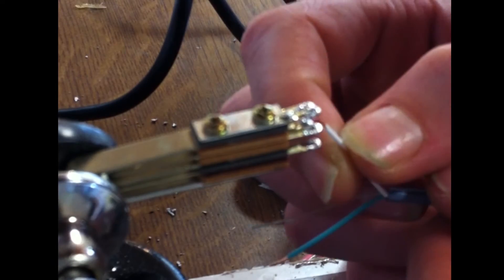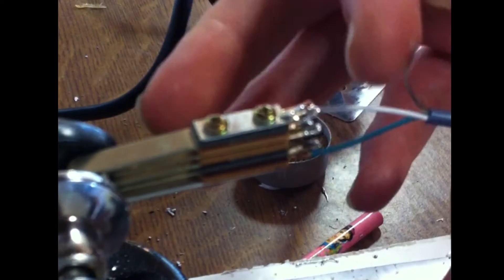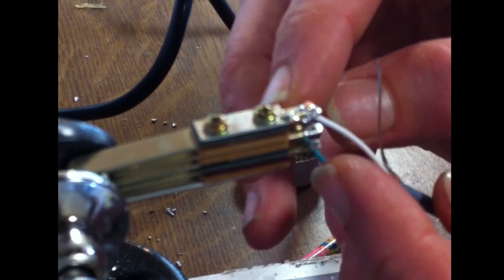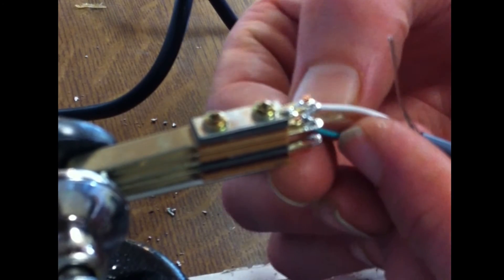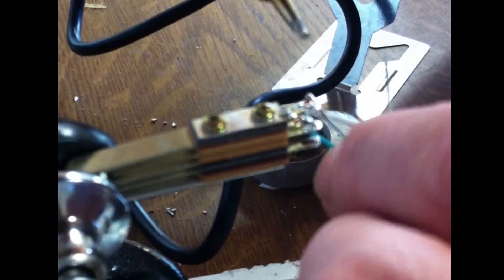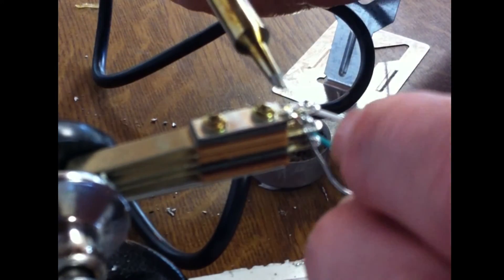In this video, I'm demonstrating that it's important to thread your hot and cold wires through the holes in the terminals and then wrap them around their terminals. This way, if there's any tension on the wire the solder won't break, due to the strength of the connection. Also, doing it this way means the wires hold themselves in place, which makes for an easy soldering job.